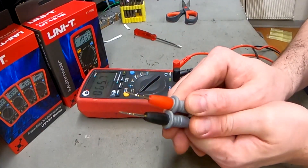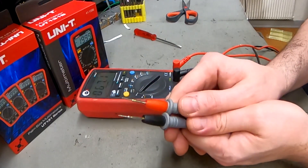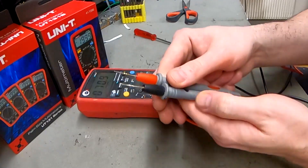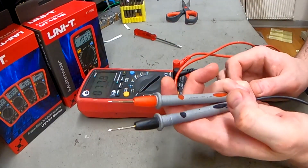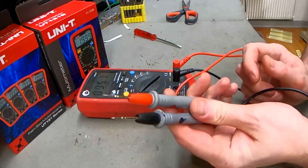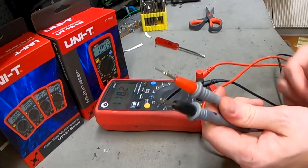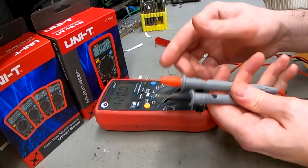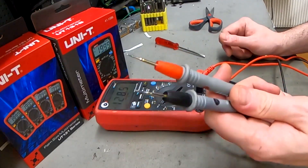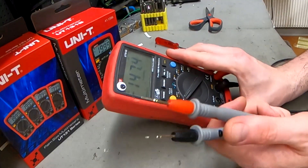If you're going to be working with batteries you need these tiny fine-tip probes. You really need fine tips to be able to measure into JST connectors and everything like that — you will not be able to do much with large probes. We import these ourselves because we haven't found anywhere in Sweden where they're sold at a decent price. Fluke has one pair for about 20 bucks. These break often — they're very easy to bend — so we destroy about one pair every six months. Buy at least two or three pairs, and a good multimeter for at least 20 dollars or euros.